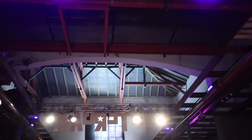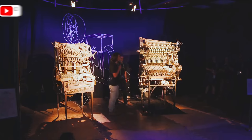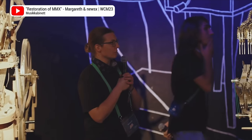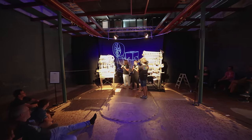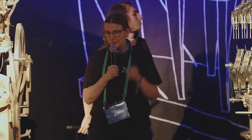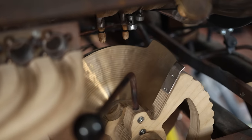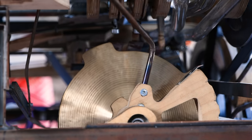Finally we had Elie and Margreth represent the Musiikkabinet volunteer team to give a summary of the struggles with restoring their machine. Welcome to the restoration talk. We knew that we wanted reference measurements and reference pictures. We knew the machine would need leveling. We knew we needed to keep track of tasks — Airtable for the win. What we didn't know was the whole host of to-dos that we would face. The rhythm machine, which is also a cymbal, needed a bit of tuning because the timing was completely off, so there was a lot of adjustment in that area.